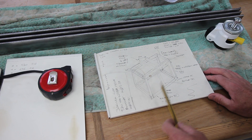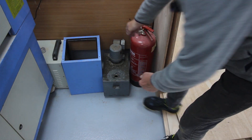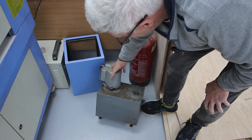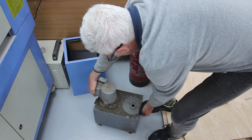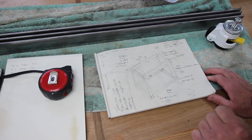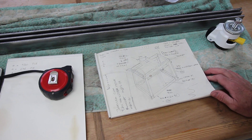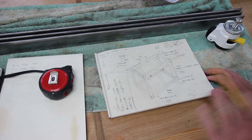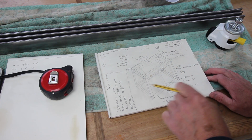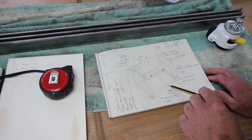The other problem I've had — and I'll drop in a shot of the old coolant tank — that's the old coolant tank and pump, and it's nowhere near big enough. I worked out that's 12 liters, so that's not enough. It was never enough in the past; the filters had to be scrupulously clean, it had to be full to the brim in order for enough coolant to siphon back into the tank, and you could only get a small dribble of coolant out of it.